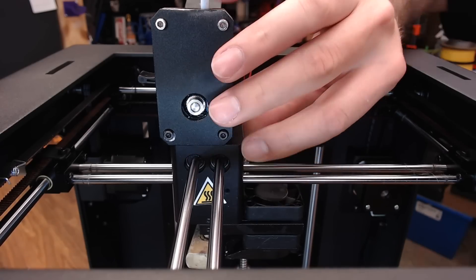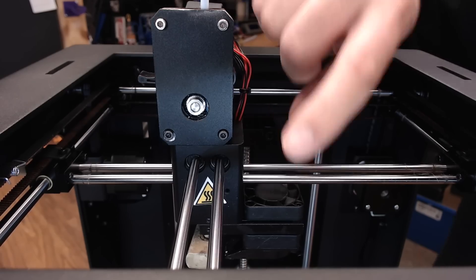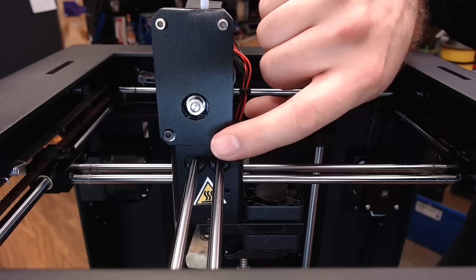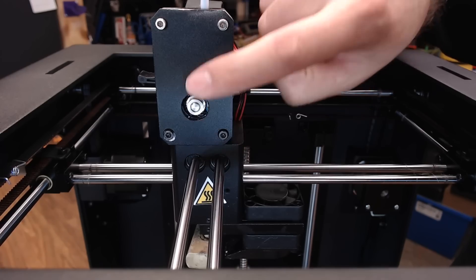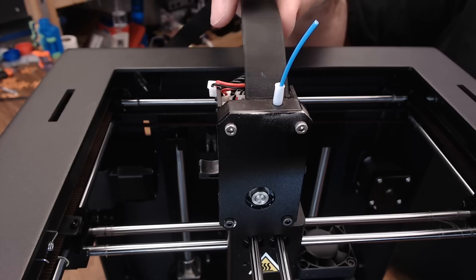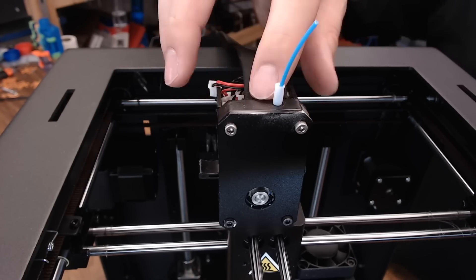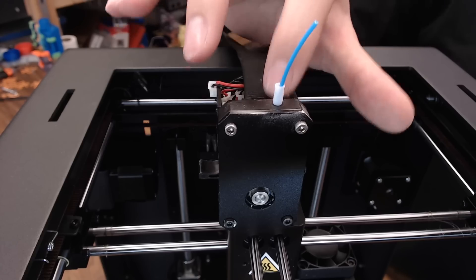The extruder setup on this is probably my least favorite thing about the printer. The filament path starts here and runs all the way down to the hot end — there's a lot of room for things to go wrong. The first time I had to take this cover off, I actually had to drill the screws out because they were so stripped, so I replaced them all with M3 screws that hold a lot better. It has a ribbon cable that runs down the back and underneath the machine to a patch panel connecting all the fans, the hot end, and the thermistor. This cable does like to wiggle loose, so occasionally you'll get a heater error out of the blue — a definite rework is needed.